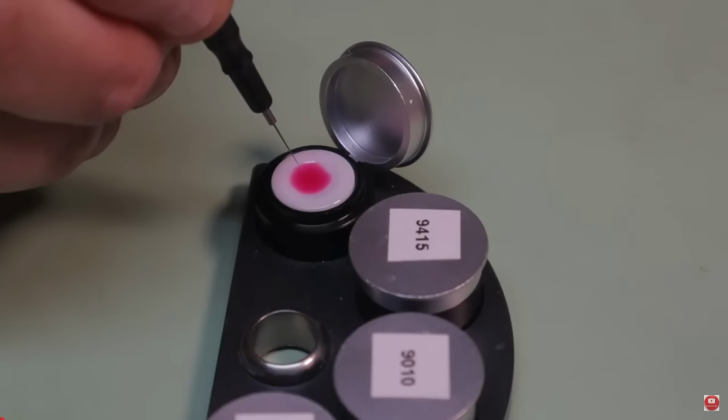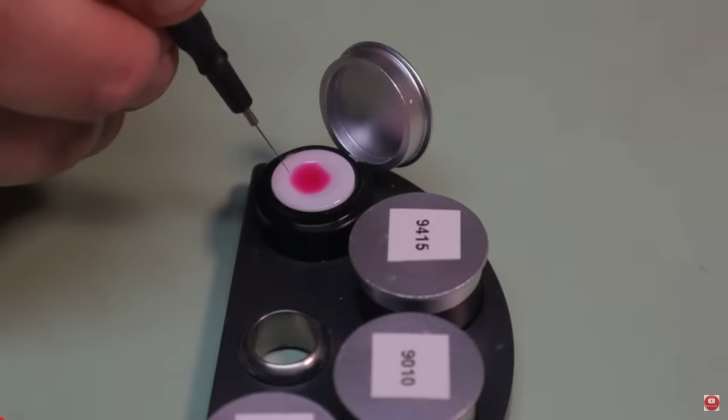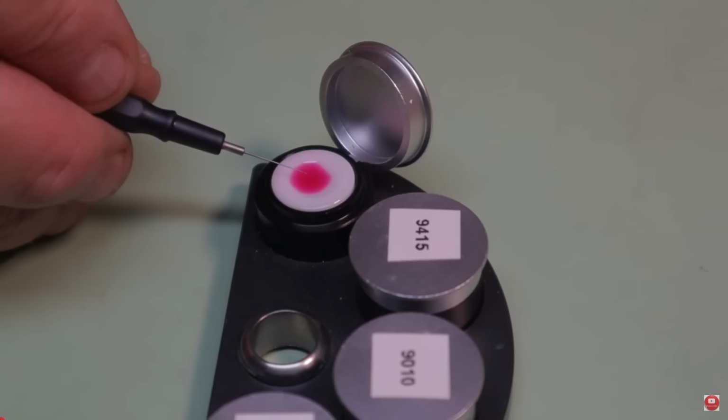So that brings us to the next question that I've been getting a lot of. How do I prevent the over-lubrication of the end stones? Well, there's a whole science revolving around how to pick up oil from the oil pot. And I did a video about it a couple years ago, so I'll just leave a link in the show notes if you're interested in learning about that. Properly oiling the end stones is critical for how well your movement runs and whether you'll be able to regulate the rate to an acceptable level.